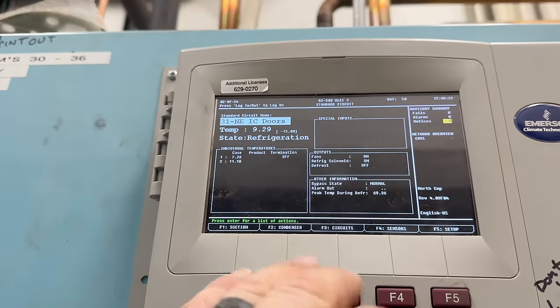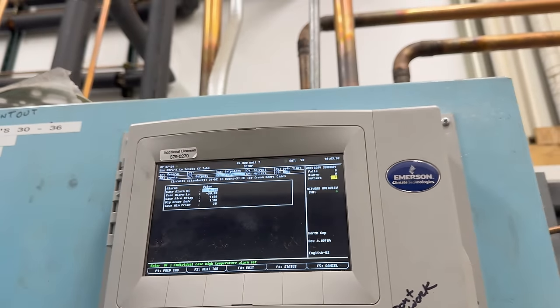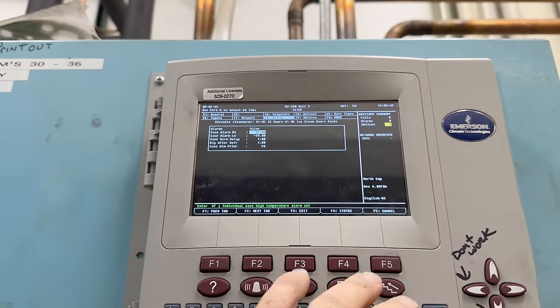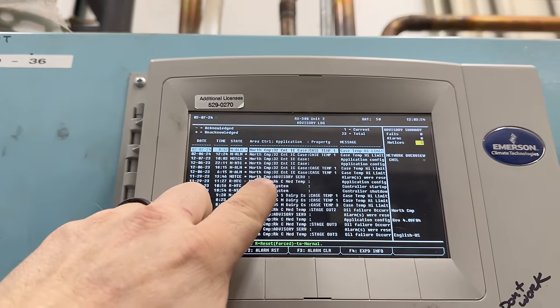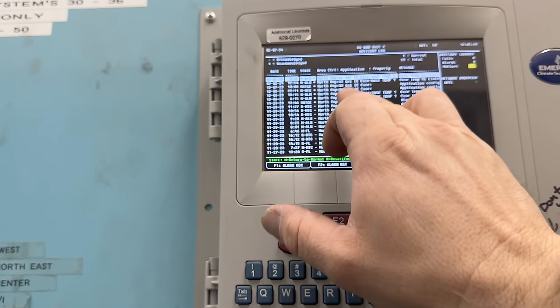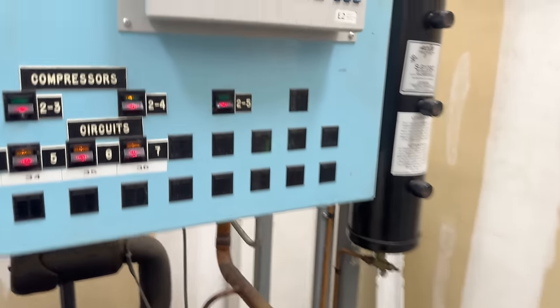One hour delay after defrost — which means it ain't going to go into alarm. And even then, 15 degrees is the trigger point. So it's already below that, so it's not going to go into alarm — it should clear out here and be good to go. So now we need to look at our alarms again. This morning when I got here, 32 was doing this deal. Coming down here, you can see 32 — short of that we don't have anything else on 32. So 32 is a newbie. That's those next set of cases. Let's go into 32 and see what our sensors are and see which one's acting stupid.